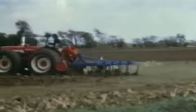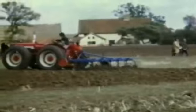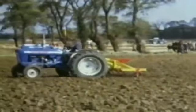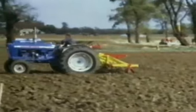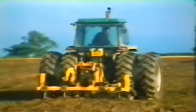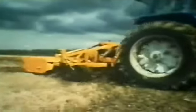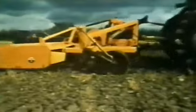By the mid-1970s, many farmers were drilling most of their cereal crops in the autumn. This work, together with the root harvest, changed the pattern of farming. Stubble cultivating usually preceded ploughing, often with one of the many models of spring tine cultivator available at the time. A new design of subsoiler appeared in the early 1970s — the McConnell Shakerator, which had vibrating tines operated by an eccentric flywheel arrangement driven by the power take-off. Linked to the McConnell Tillerator, this combination converted stubble fields to autumn seedbeds at a rapid pace.